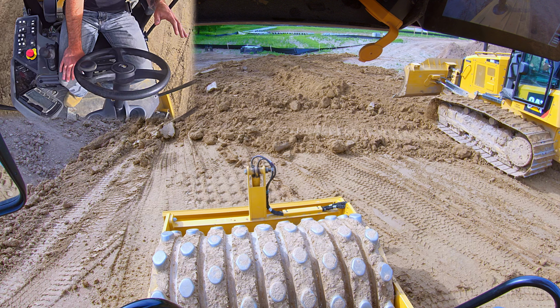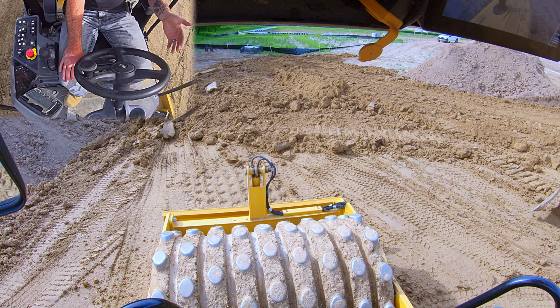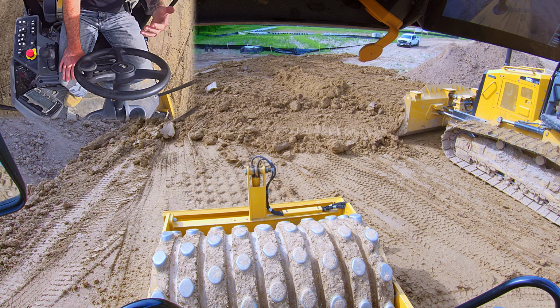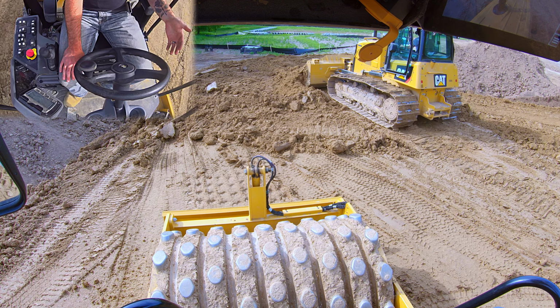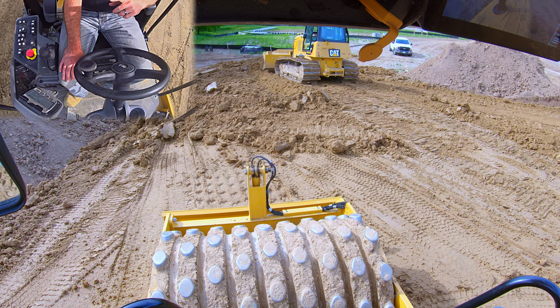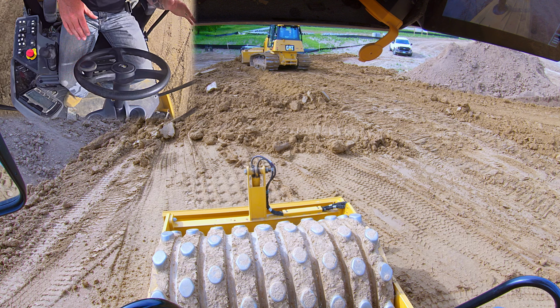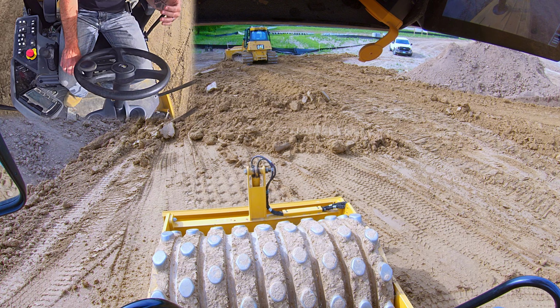Another concept I want to talk about is staying out of your dozer operator's way, especially when you're chasing him doing any sort of a finish grade. As you can see here, Colton is backing up almost even with me. If we roll this area and he backs up to make his next pass, not only is he going to mess with the grade that we've already rolled, but if he's using GPS, he will be at a different level because this is compacted versus non-compacted up there. It's going to mess with the grade. It's not going to come out nice and even.